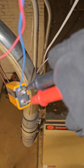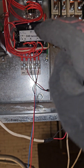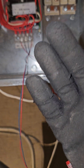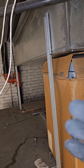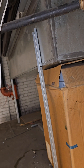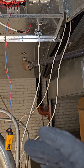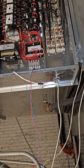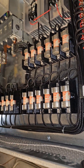I was on the money, guys. So to solve this problem permanently — because the installing contractor did not understand that they had to put a separate 10 volt DC supply here — with that you can use a modulating 0 to 10 volt DC supply. Based on temperature set point, a controller will emit between 0 and 10 volts: when you're further from set point it emits 10 volts, and as you get closer it drops — 5 volts, 6 volts, 4 volts, 2.5 volts — until you reach zero at satisfied. I'm going to have to get an AC-to-DC power supply that outputs 10 volts, or get a modulating controller. Comment in the comments section if you have experienced this type of electric heater.